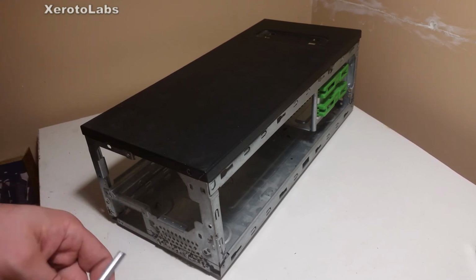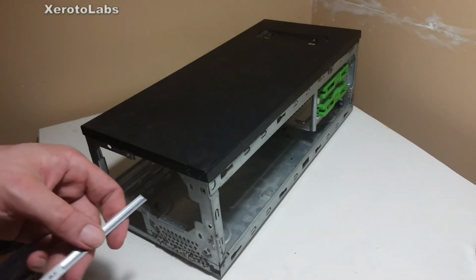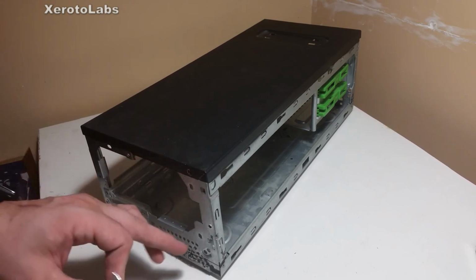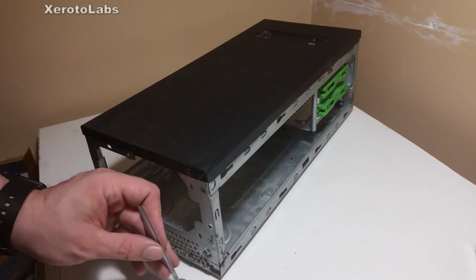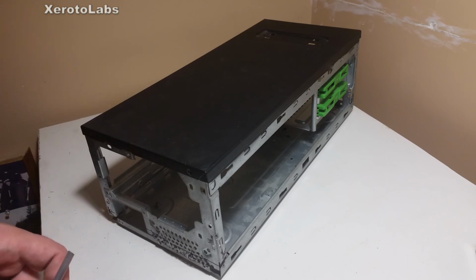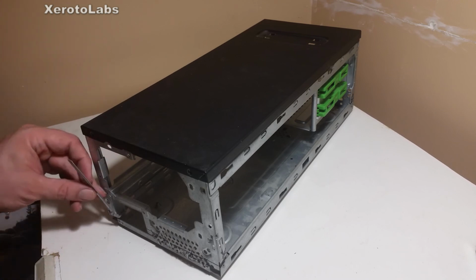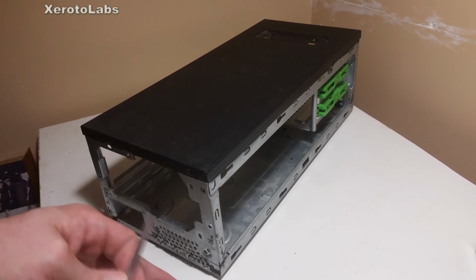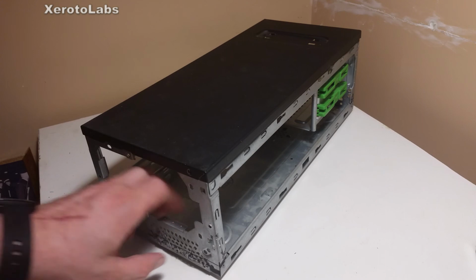My current idea is to flatten this out, which is threaded for the size of a standard PC case screw, and drill some holes, and line it up to where the power supply screws would be, and then put the case screws through this into that for the power supply, sharing the same screws for the power supply on both sides. That should work pretty good. And then when it's in place, I could sand it a bit and slather the pieces with JB Weld onto this side.